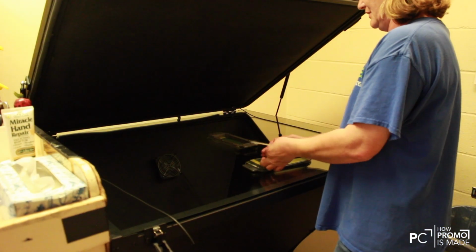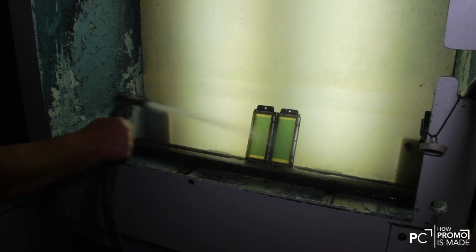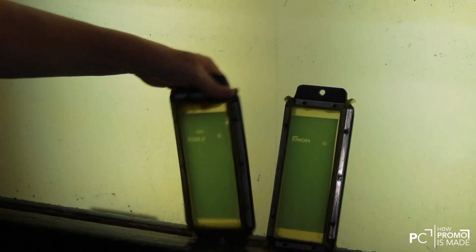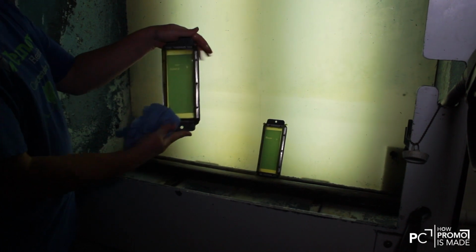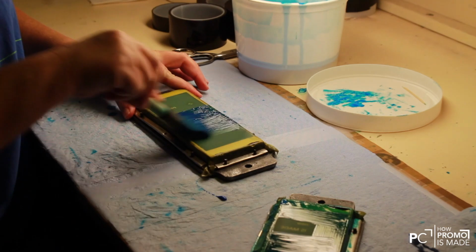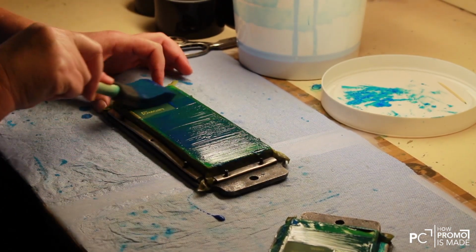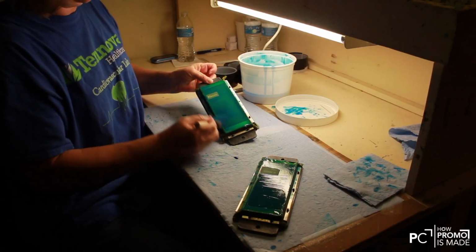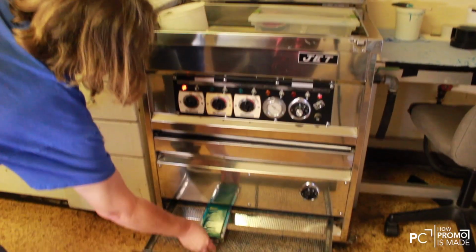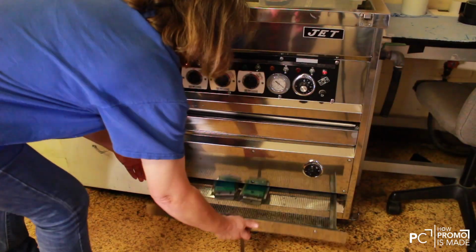After 10 to 15 minutes, the films are removed from the screens. Then the uncured emulsion is washed out, leaving behind the logo. The screens are dried and then sprayed with compressed air to make sure all the uncured emulsion has been removed. Next, a layer of ink stop is added to the screen to ensure that no ink leaks through any imperfections. Once the whole screen except the logo area has been coated, the screens are placed into an oven to dry the ink stop.